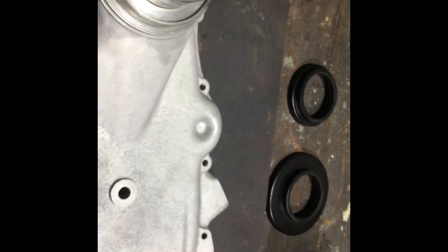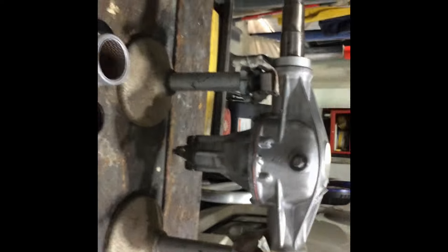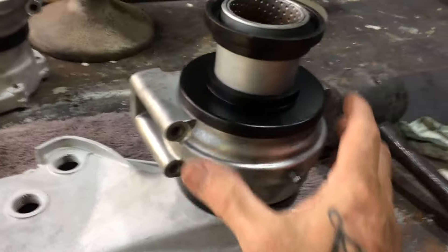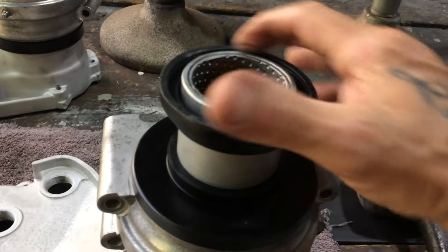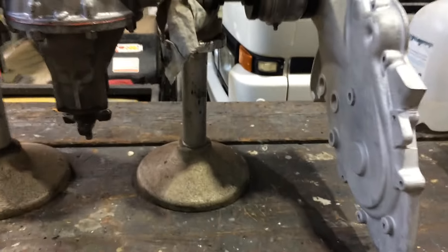I can't exactly remember how it all goes back together so I'll look at the exploded parts view. I've also sanded that with 800 grit and annealed it - you can do that with copper as well, you don't have to replace those, just heat them up to soften them and reuse them. You pump that with grease, it spins down and locks in. You just tap these down with a rubber mallet, then that part goes over it and slides on there.